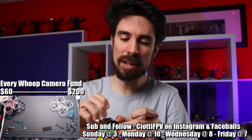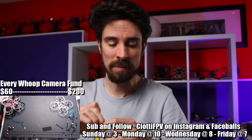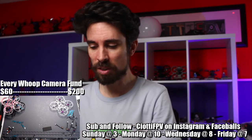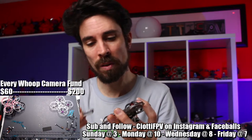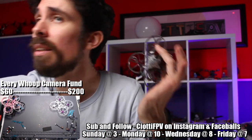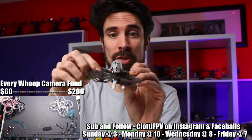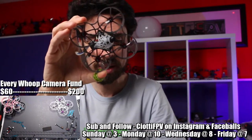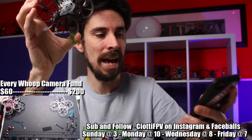I've put extra tape on a bunch of my fat boy batteries because on the previous best 75 millimeter frame, the Mobula 7 V4, the batteries fit a little bit loose. But on these Meteor 75 Air frames, the batteries fit properly in there. So now I'm having to pull all the tape off. So this is a 75 millimeter freestyle rig, Meteor 75 Air frame, super lightweight battery, 0603s. This is about as lightweight as you're ever going to be able to build a Walksnail 75 freestyle setup with out of the box stuff, without going bananas.